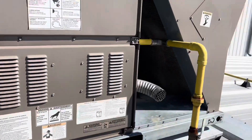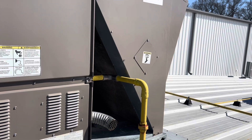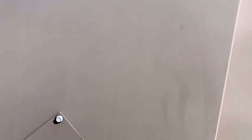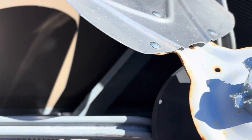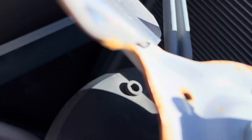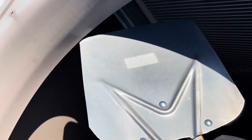I'm pretty sure it's unit number seven so we're going to look into it - I'm going to check the compressors. What happens on these, it doesn't matter what vintage it is - if it's a York Predator unit this happens all the time. The condenser wires came loose and the blade chopped them right in half. Happens all the time. This fan blade actually bent - it probably got caught on that wire and bent itself. It'll certainly need to be changed.